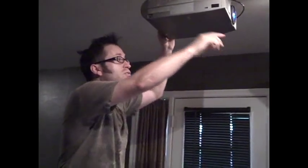One other thing to note is this is not a normal mirror. There's a normal mirror in the back there, but we actually had to get a special mirror and paste it on top — it's called a first surface mirror. Normal mirrors that you buy at the store have a piece of glass over them, and then the actual mirror surface is behind it. What that means is your light travels into it, hits the glass, then shines down, then hits the mirror and shines down again. So what you get is a big double image at the bottom — you don't want that. You want a first surface mirror.